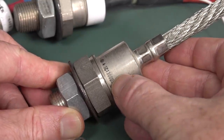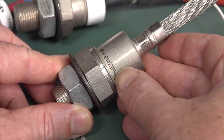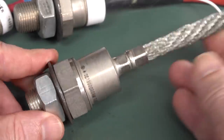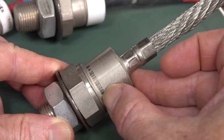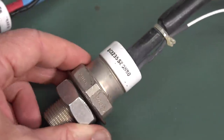So that probably is like 1300. The part numbers usually give away the current and the voltage rating, so that could be 1300 amps. I mean, just that kind of beefiness. Yeah, I can picture that being 1300 amps and D30. Well, it was only 30 volts. I doubt it, but anyway, that's got to be a diode. That'd be a Schottky diode, and this would be the SCR.